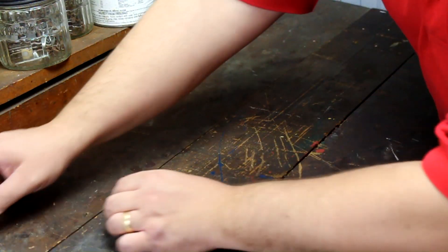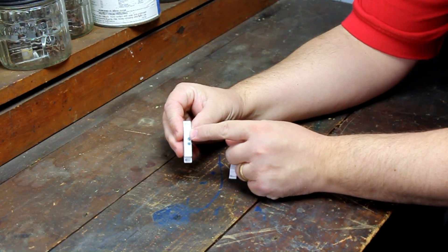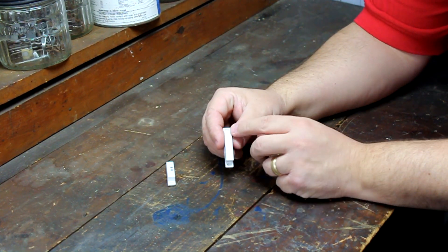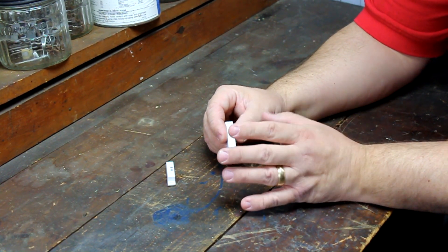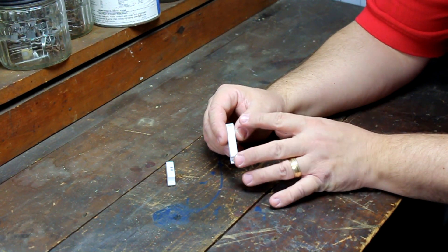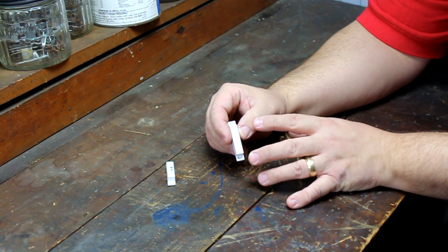The first of these devices I'd like to show you is the magnetic reed switch, also known as a surface-mounted door or window contact. This device monitors if a door or window has been opened. This device consists of two pieces. One piece is nothing more than a magnet in a plastic housing. The other piece is a simple electric switch made up of a ferrous metal. Inside the plastic housing, this switch is sealed in an airtight glass tube. This is to prohibit the metal from oxidizing.